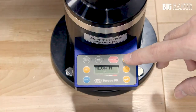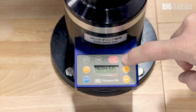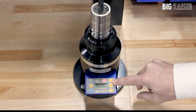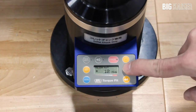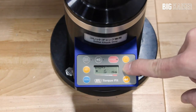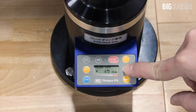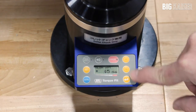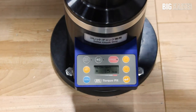The measurement screen has presets for all of the Big Daishowa chuck series. In this case, I have a Mega New Baby chuck in the device. I select Mega N and then choose a holder size and cutting shank size option. This holder is a Mega 16N that has a maximum tightening torque of 45 Nm. I press select to activate the size and zero out the screen.